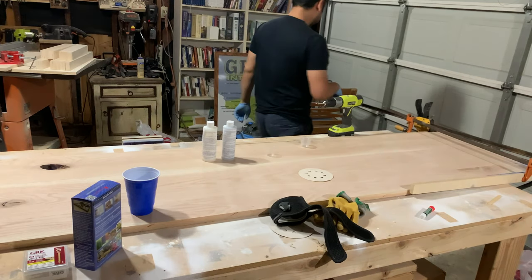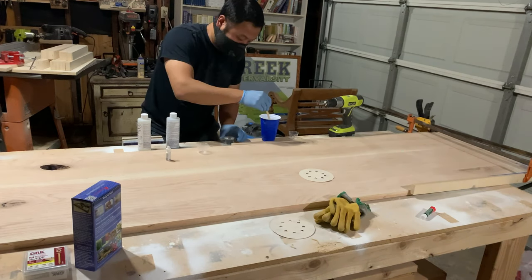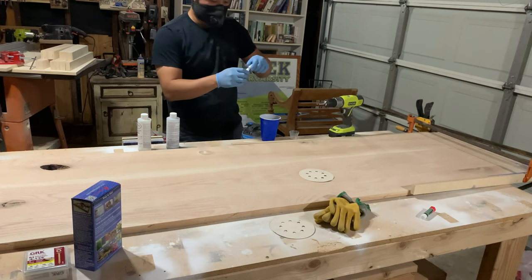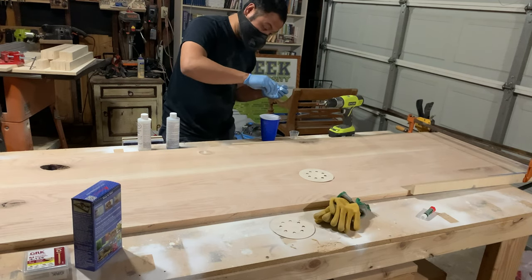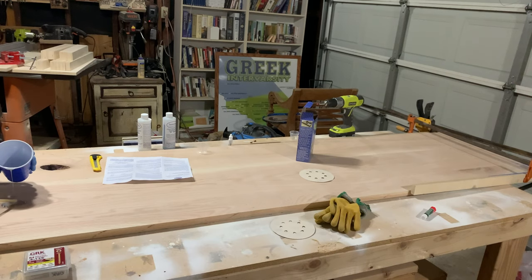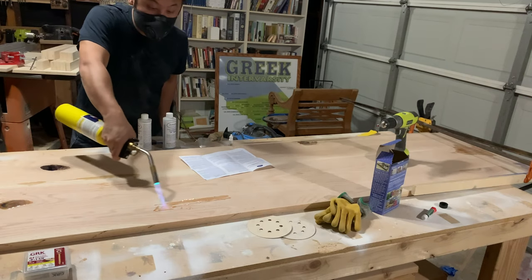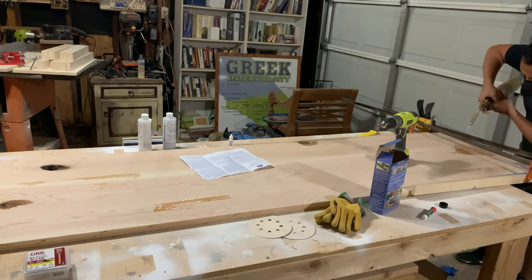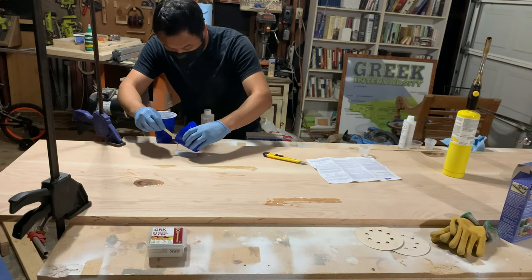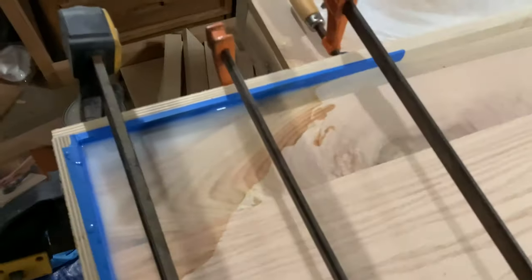Next was to get out the actual epoxy and begin to mix it together. I put on a respirator because once I opened up the epoxy, man it totally stank up my garage — so make sure you're using a respirator when you're working with these chemicals. I put in a couple drops of white dye from my epoxy solution, stirred for about 7 to 10 minutes, and began to pour the epoxy. Here I'm using a sharp edge to poke holes in the epoxy to make sure it gets all the way to the bottom of the pour. Once I was done pouring I got out my plumber's torch and used it to get all the air bubbles coming up from the epoxy. After that first batch I made a second batch just to fill up the knot hole. And here is the end result from the mold — no leaking or anything underneath, which means it worked great.